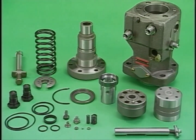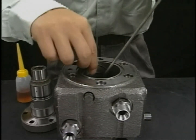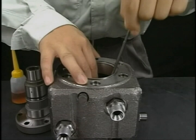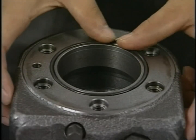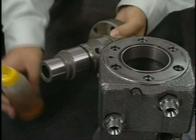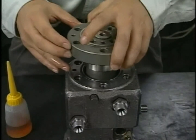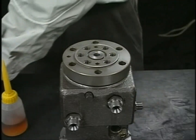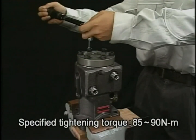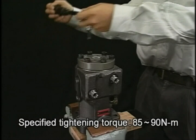After checking, reassemble with the necessary parts and replace all O-rings. Reassemble the fuel injection pump in reverse order of disassembly, starting with the barrel body. Tighten the bolts of the barrel guard and of the delivery valve evenly in three steps by the specified torque.